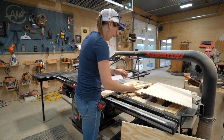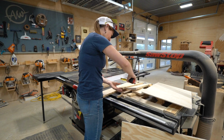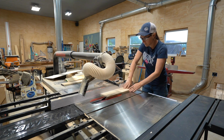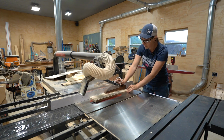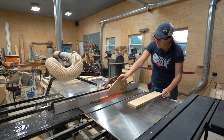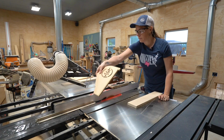It doesn't really matter what width or length you make this jig. However, it'll make your life easiest to do math if you make the width of it an even number. I made my board 4 inches wide. And then for the little shoe, you want to make it the same height as the jig, and I made mine 1/4 of an inch.